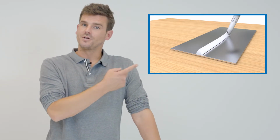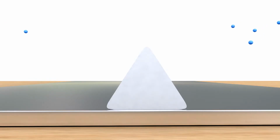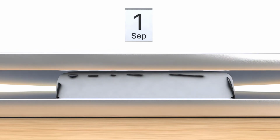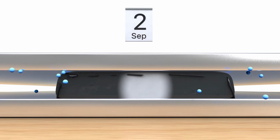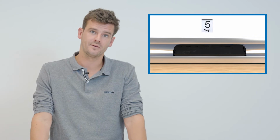Here, you can watch the curing process of a moisture curing adhesive such as silicone. The air humidity hits the outside of the silicone and immediately starts the reaction. A skin is formed, which means you should only bond your components within the skin over time. That's the only way the adhesive can actually stick to the surfaces. Later on, the air humidity needs to penetrate through the already cured material. This explains why with silicones, the curing time is slightly longer than with other adhesives.